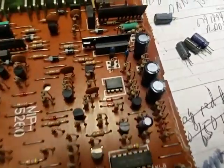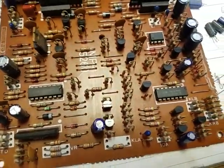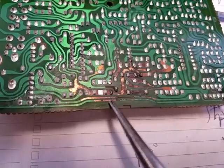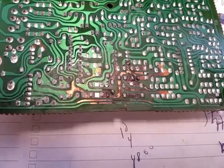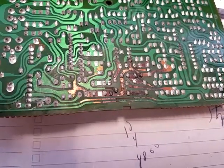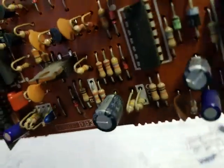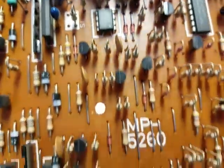What I've done is pulled the capacitors off of a TV board because I don't have high hopes for this. Most of these traces are open — even some of the big ones are open right here. That's probably the reason why it completely failed when the traces went open. But we're going to give this a shot. This corroded solder is really hard to work with. These are Panasonic capacitors, and it's only the big ones that have leaked — all the smaller ones still test good.